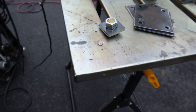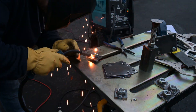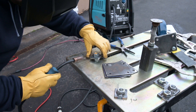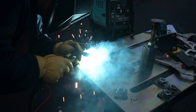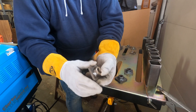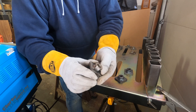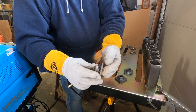We're going to weld this last one up over here and I'll show you how it goes. I know I MIG welded these, but it was tough to get a really good weld all the way around. So what I think I'm going to do is TIG weld a little bit more around these. I soaked these in some muriatic acid and stripped the zinc off the nut and also stripped most of the mill scale off to make it easier to weld to. So we're going to go ahead right now and do some TIG welding.